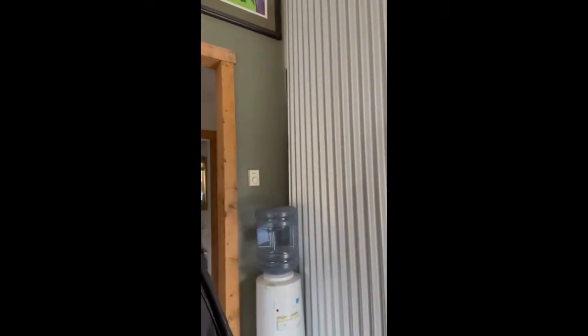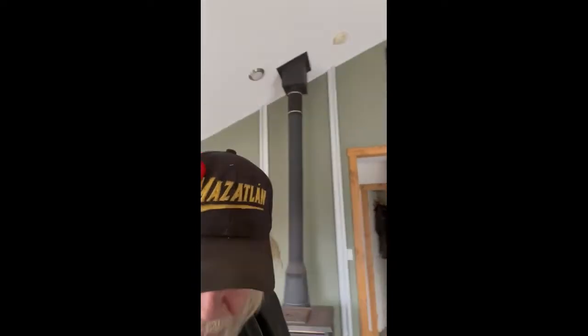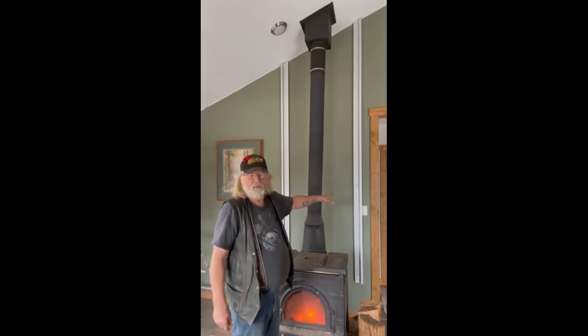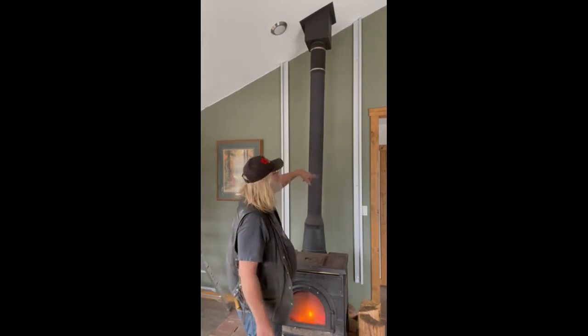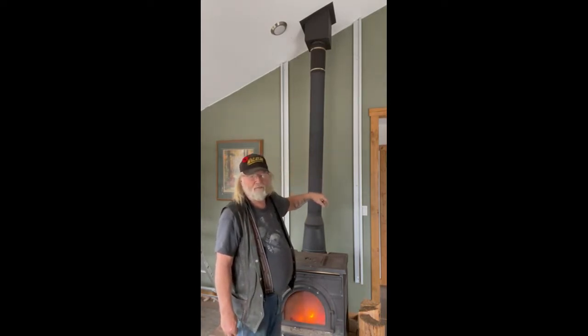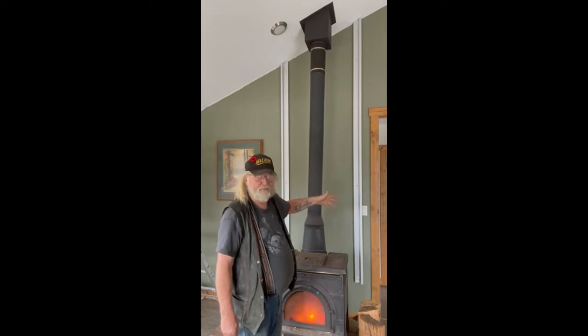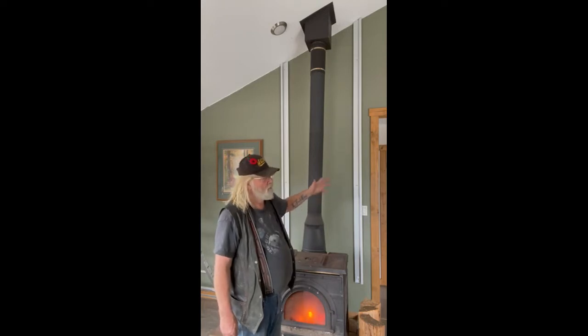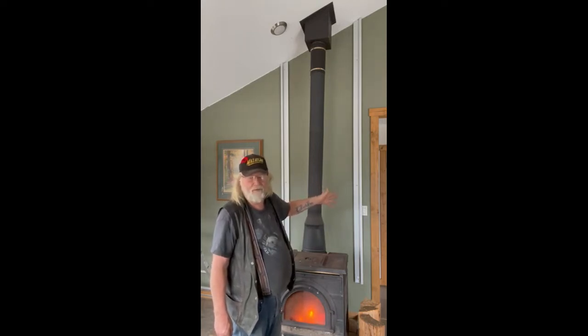I got this panel over here just leaning against the fridge, and I do have it cut at the top there for a 5/12 pitch. And we're going to have that put in behind there. I got 3 of these J mold pieces. 2 were the uprights, which I got installed. But the third piece, with my fancy tape measure and measuring device, I managed to cut the angles on it wrong the first time. And the second time I got the angles cut right.